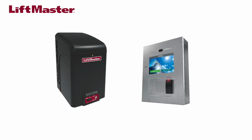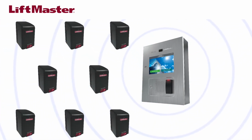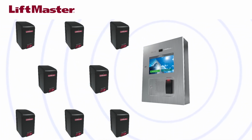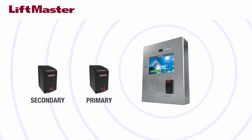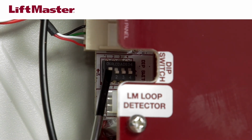If you choose to, instead of wiring the CAPXL to a gate operator, a wireless connection can be established. One CAPXL can control up to 8 LiftMaster gate operators wirelessly. This includes open commands, hold open commands, and receiving diagnostic information which can be configured in MyQ Business notifications. If using a primary-secondary operator configuration, you can only program the primary operator to the CAPXL. You should already be in admin mode. If not, flip dip switch number 1 on the CAPXL Power Internet board to the On position.